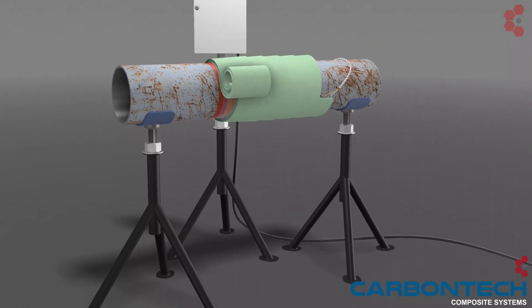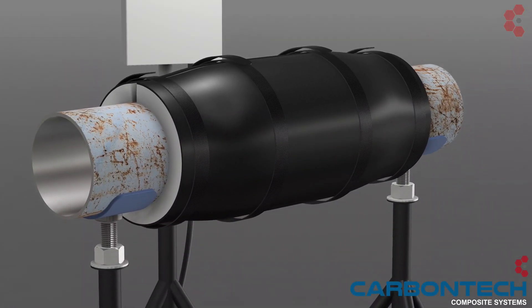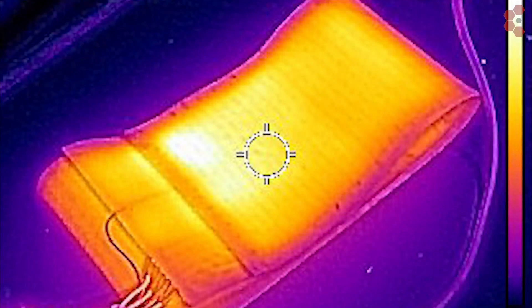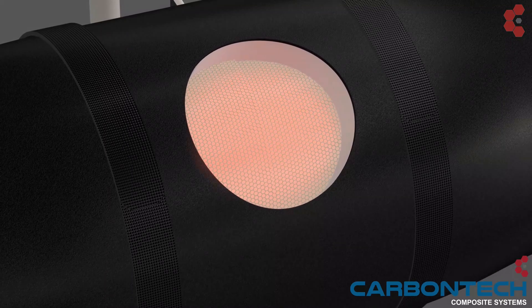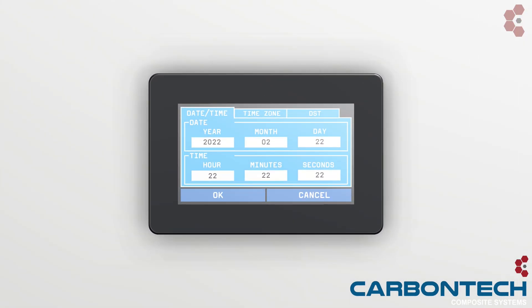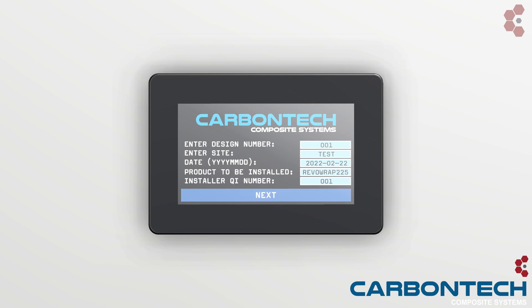In cases where post-curing is required and we cannot rely on heat transfer from the host pipe, we have developed the versatile RevoMat — a uniquely developed product for the post-curing of RevoWrap systems. RevoMat is a durable, lightweight, temperature-controlled silicone blanket designed for ease of use and to safely post-cure pipe wraps in challenging environments. The RevoMat controller is an intelligent system that monitors its own power input relative to pipe surface, ensuring a stable cure temperature even if the pipe temperature fluctuates. The system is pre-programmed for all our resin systems and records and graphs the cure cycle, providing selected and input data for quality control reporting.